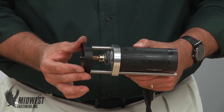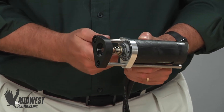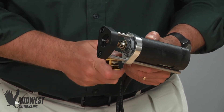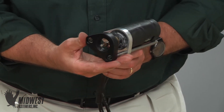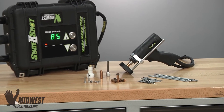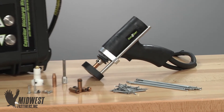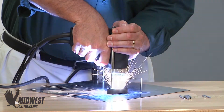Slide the legs and foot until you have an eighth of an inch of pin sticking out, assuring proper protrusion and weld timing. Once the eighth inch is set, tighten both set screws to keep the foot firm during welding. Again, if your job requires different length pins, make this adjustment to each pin length, always ending with the proper eighth inch of protrusion. Welding is simple — load, contact, and weld.